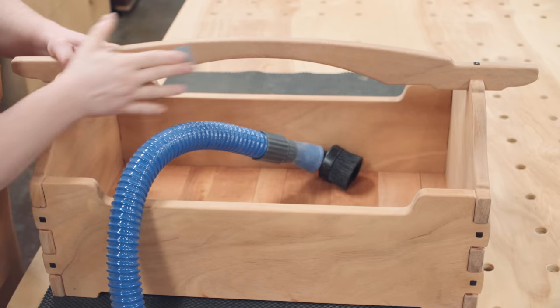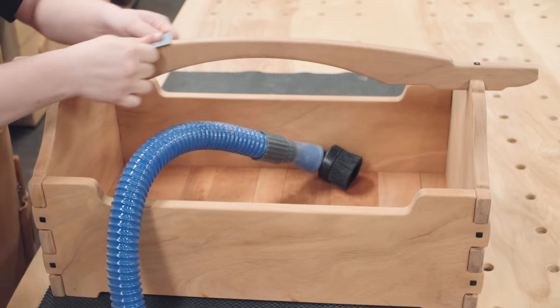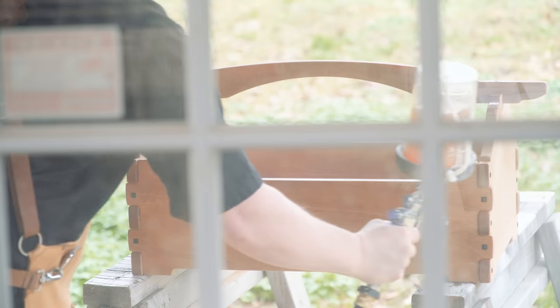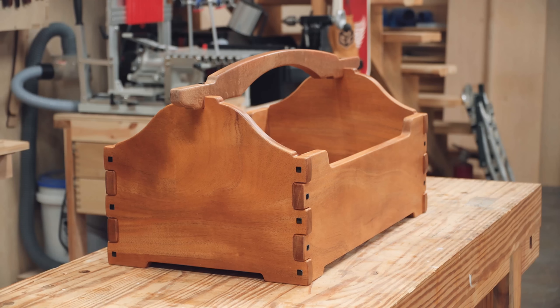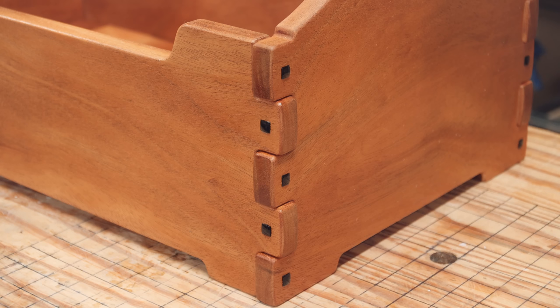The next day I prepped for finishing by sanding and vacuuming everything to remove ebony dust that got into the mahogany fibers, then sprayed the finish outside. It was a pretty cold day so I immediately brought it back inside to cure in the shop. I just started the finishing process and I'm not finishing the finish yet — eventually I'll add a few more coats of shellac followed by a scuff sanding and wax, or just a coat or two of satin polyurethane. I didn't want to complete the finish just yet so that I can easily scuff the surface on the inside and glue some tool holders in. After I get all the tools and holders placed, I'll complete the finish.